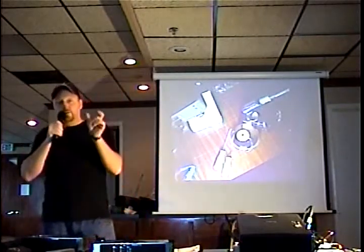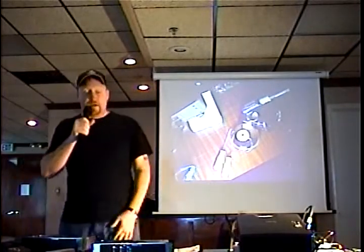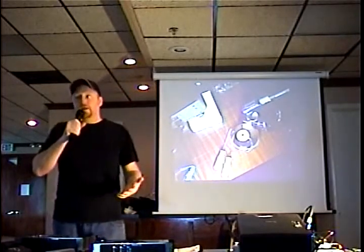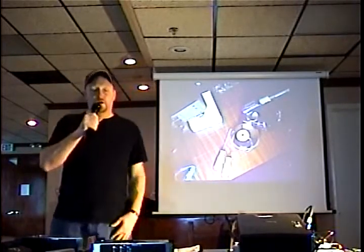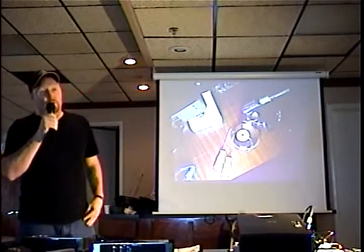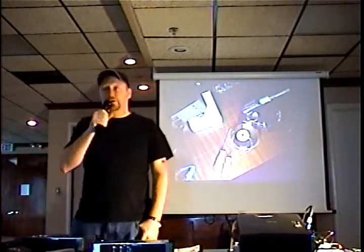Another thing is with solder, sometimes it's hard to tell if you've got those two points actually bridged. I've had cases where you do the solder, you put it back together, you try to flash the BIOS, and it doesn't flash because one of the points isn't all the way soldered. I haven't really ever had that problem with the nickel print or conductivity pens. As long as it's clean, take a little alcohol or something and clean the area, you should be able to get conductivity between those two points.